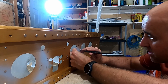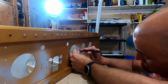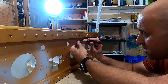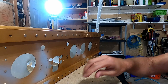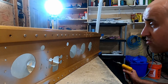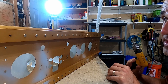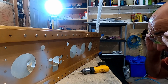You can kind of see if it's misshapen when it was bucked, because almost every bucked rivet is misshapen just a tiny bit. Make a good estimation - these are eighth inch rivets and I'm going to center punch them right about where I'm fairly certain the center is on the shop side. This one's actually squeezed at all sorts of weird angles, so I think it's actually going to be down quite a bit from where the center might appear. That one might be a dangerous one to remove - you have to be very careful. I'm starting with a number 41 drill bit, which would normally be used to remove a 3/32 rivet, but I'm starting with this on these just because I'm working on the shop side and you've got to be very careful.